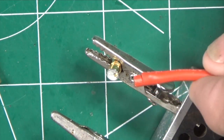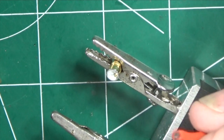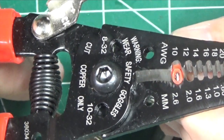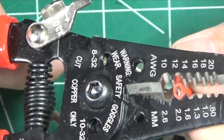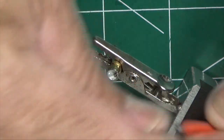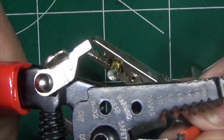Now we want to prepare a wire to go inside, so we want to strip this wire with our wire strippers. Make sure that we're cutting the insulation and not the wire, because we need the wire. We're going to gauge the diameter of the wire to the cutout — we can move up to the next size and try that. That did pretty good, so we cut the insulation without cutting wires. A couple of wires is not a big deal if that happens. We can actually go a little longer on the strip because of the connector type.